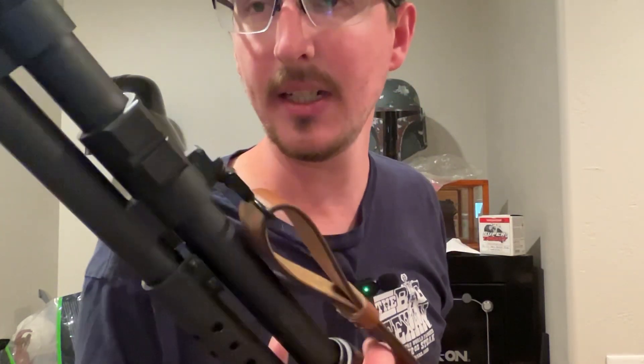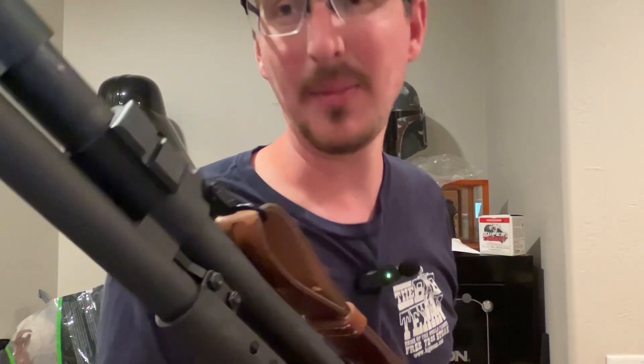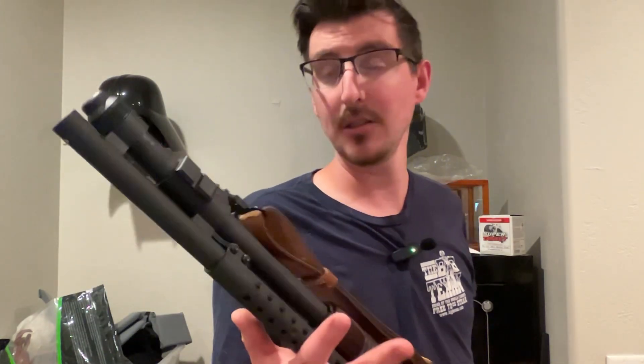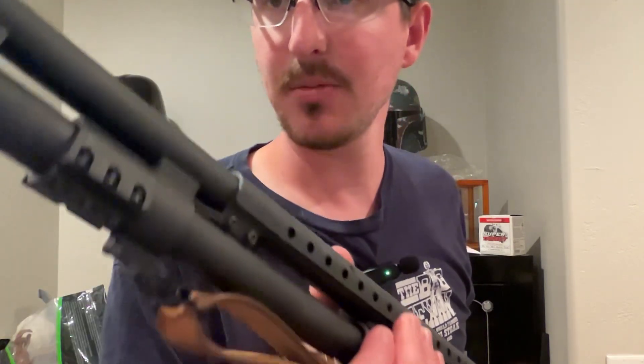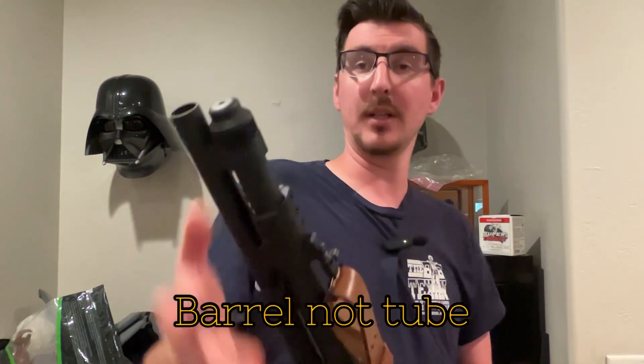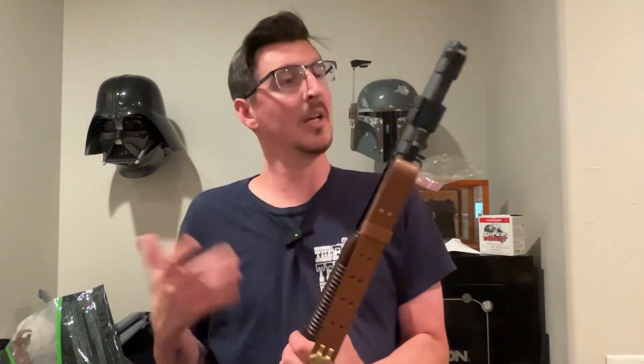You've got a bit of rail there for a light. They recommend it for their SuperTAC and TL series, but I imagine you could put just about any light on there. I have a TLR1HL that I use with it. It has three screws. To install it, all you have to do is take your barrel off — partway, with my gun I have to bring it up until this is off the tube but this is still on the tube — then loosen up the mount, slide it on, slide the barrel back on, and put it in position where you want it. If you want to use this with a bayonet like I did, you basically have to get it flush up against the bayonet lug, then tighten it down.